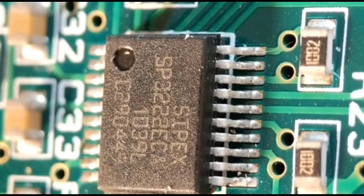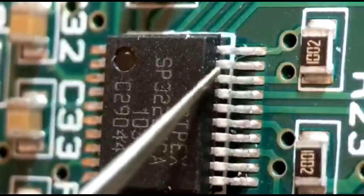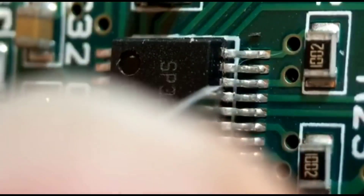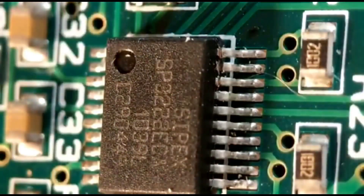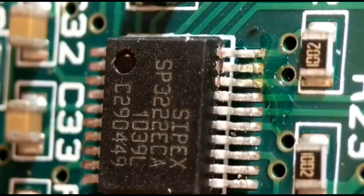Now for the second method — I'm going to take some pins off this old IC. I'll take the first three pins off and show you how, then literally put them onto the other board. Instead of wire links, I'm using three proper pins. To remove pins, just scalpel across the top gently — score across about halfway down two or three times, then go straight through and you'll hear a nice little click. That's all three cut. Put a little bit of flux on the solder end and gently lift them off.